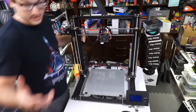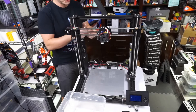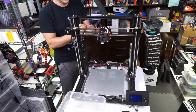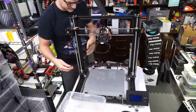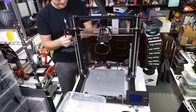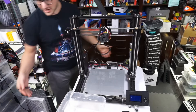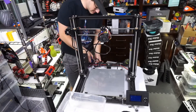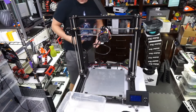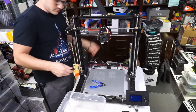If you guys saw my review of this machine, I really did like it. I thought it was quite an awesome little go for A-Net. What they were able to accomplish with this thing was impressive. And this mod I'll be doing — I'm reusing a lot of the hardware on this. I'm also replacing some of the hardware as well, just with some better components. We're going to get off the 8-bit board and things like that. So definitely we'll have a few better components here to work with. We won't be using any end stops. We're going to have sensorless homing. We'll have a flex bed on here. So we're going to have a capacitive probe — an EZABL that I have laying around — which I believe will still do the trick.